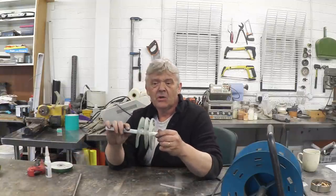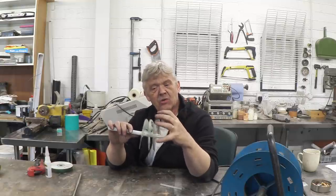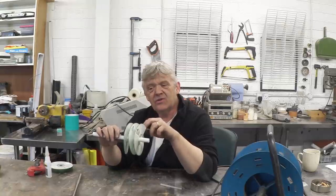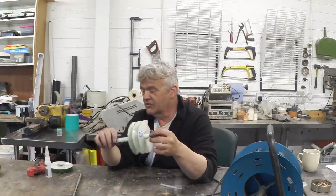I was asked to look at making an Archimedes screw. Unfortunately the Archimedes screw as a helix is in fact quite difficult to make. There are a couple of interesting parameters: one is the pitch, which is the height between one section and the next. One section is not called a screw or a thread — it's actually called a flight. Then you have the external diameter and the internal diameter. There are flight calculators online — you can put in 'Archimedes screw flight calculator' and it will calculate what the flat profile needs to look like, because the standard methodology is to cut a flat profile and then stretch it out like a spring to make the actual flight.